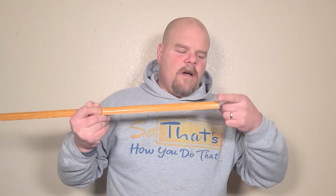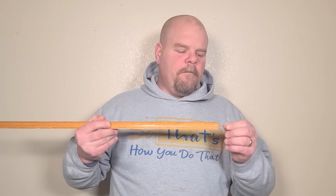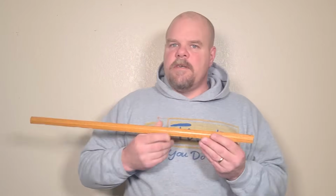Now a lot of times what will happen when you have that door that is flush with the sheetrock, if you have a trim next to it that dives in a little bit and gets thin, like maybe a 1/4 inch thick, well, this is going to be bigger and stick out past that trim. And so what you can do is take this and put it on a chop saw and just cut off a little bit of it at a 45 degree angle on the end. Now I still have part of the flat part on here, like maybe a 1/4 inch of flatness, and then I started my 45 degree. Okay, now I'll try to get a better close-up of this to show you, but then I would just stain the edge of this so that it looks nice. Now that's going to look nice.